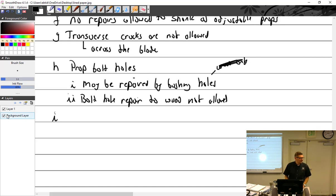I told you guys about the mechanic who put the wrong crankshaft in an O-235, because there's different flanges. They're all 235s, but there's different versions. What's the C version, C1 and C2, I think? Somebody actually looked this up. No, it's not the throw. It's the size of the flange. You actually mentioned it to me, the C1 versus the C2. I think you did, Vin, when you were looking for a bushing. So there's different ones, right?